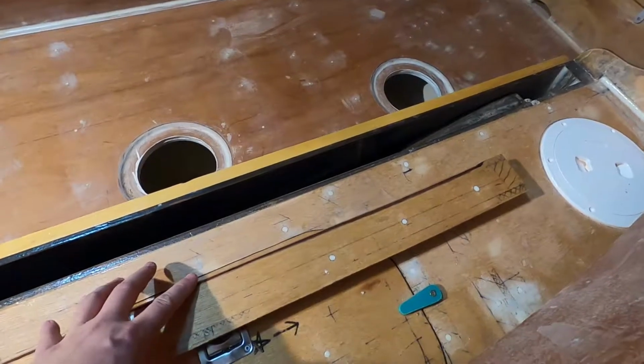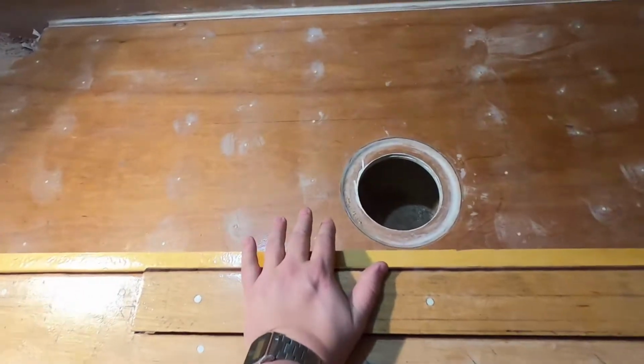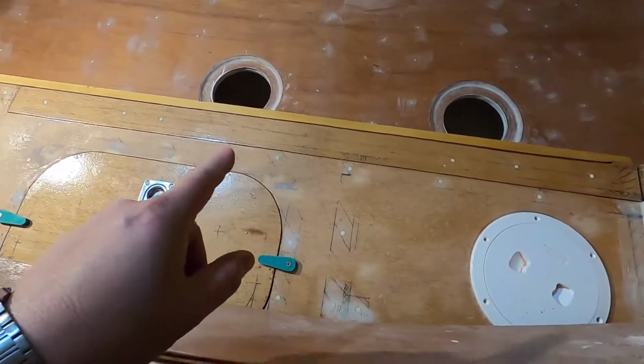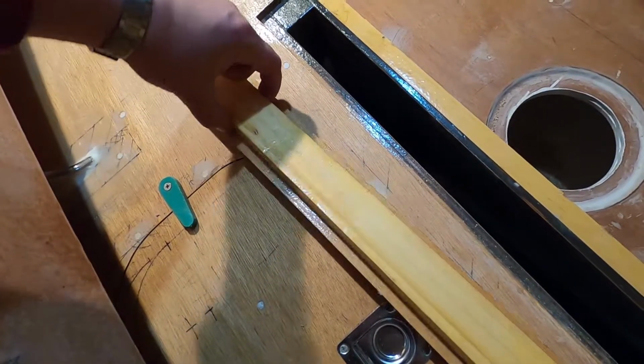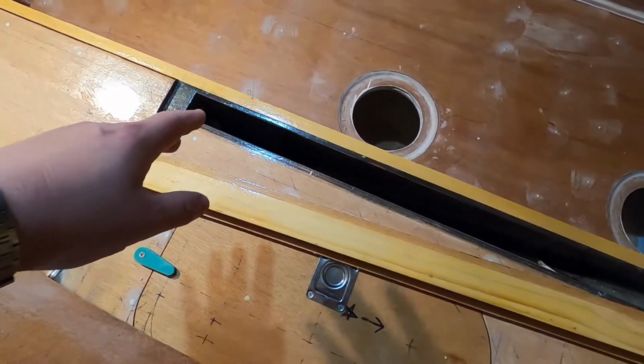So we have the centerboard cap here, and it goes in here, and it covers the centerboard trunk. This should be removable, so you can get at the centerboard later. Maybe remove any obstructions and things like that. In the plans, it has screws coming in from this side, which go through this meaty bit and hold it in. Just regular wood screws.